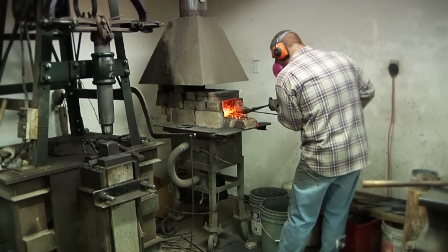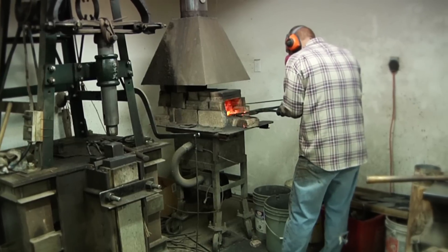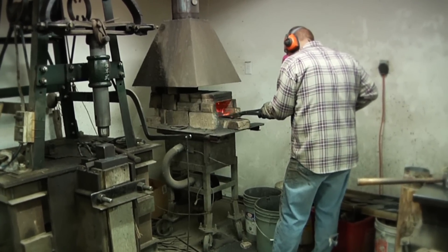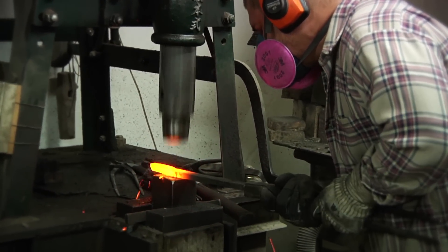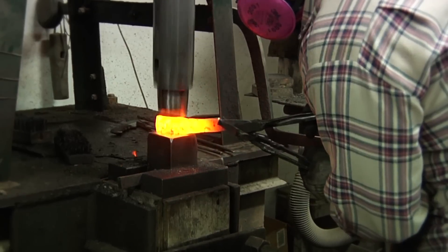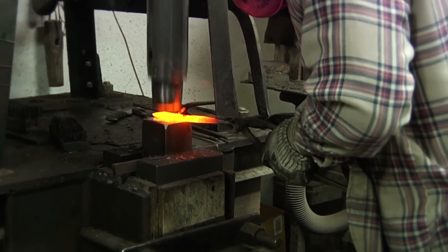The reason why I heat the steel at a lower and lower temperature as I'm forging a blade to shape is to refine the grain of the steel. For example, I'll start forging a new billet of steel at a bright orange heat — maybe that's around 900 degrees Celsius.